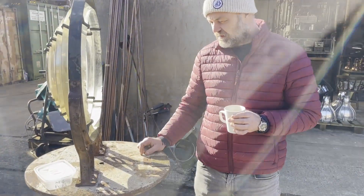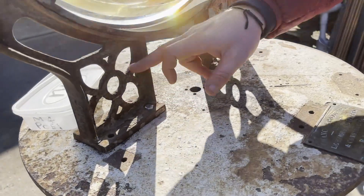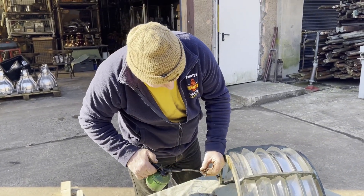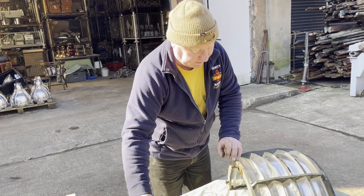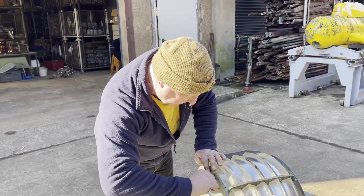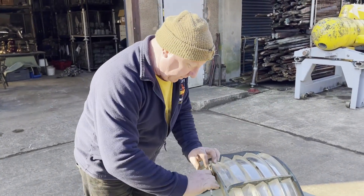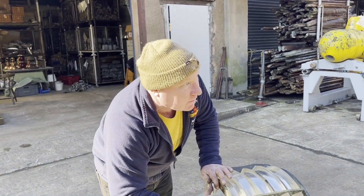Often the plates are missing on these sorts of things. You can see how much pride was put into the making of these — and nobody ever saw them other than the lighthouse keeper, all tucked away in a big tower. UNC — Unified National Coarse — and then you've got UNF and loads of different threads. Was UNC like an old standard? Whitworth was older — he was the first man to sort it all out. Before that, nuts and bolts used to be made individually; you'd have a bag of bolts and a bag of nuts and the best fit was what you used. Whitworth standardised it all.